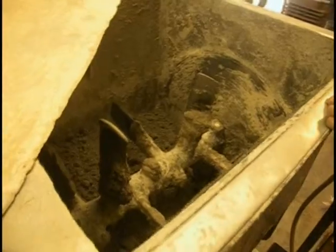Now the clay is in what we call the pre-pugger and we are mixing it with water. This is a very large machine — it will hold a ton of clay at a time. It is very well mixed. The mixing process takes about 15 minutes.